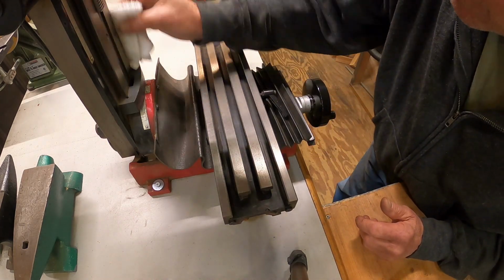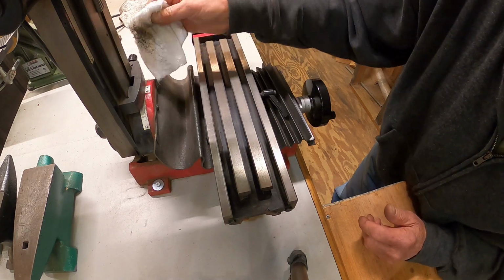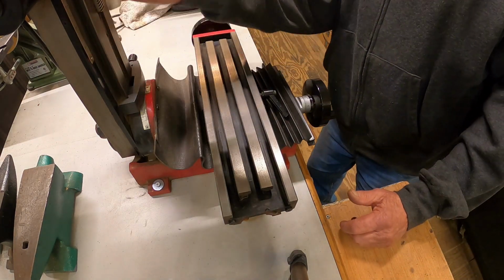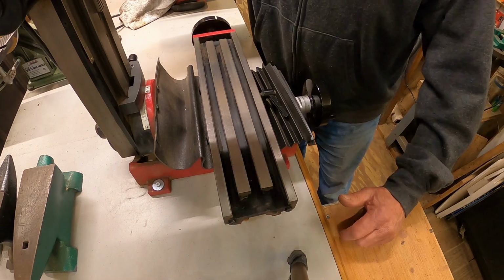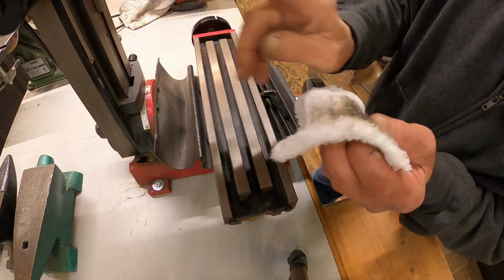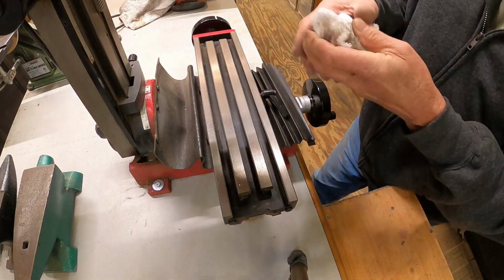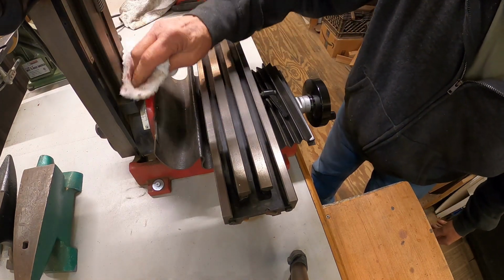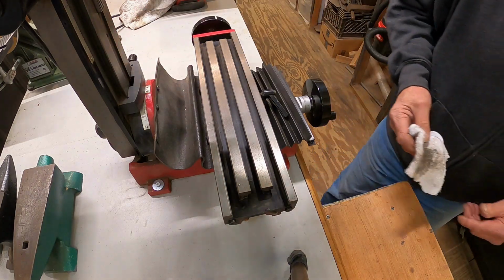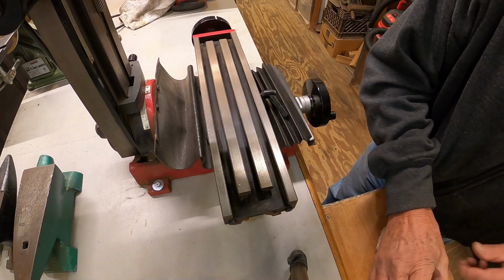I'm just gonna wipe down these surfaces here. Now these get oil up in here. I'm gonna oil these instead of wax. And the sides. I'll put some wax on the sides. But anything that moves, and I adjusted the gibs in here, they're on the other side. I got it where it's moving real nice and smooth. Excuse me, just like that. Now walk around to the back side and get that in a minute.